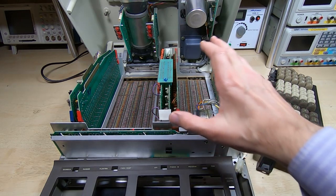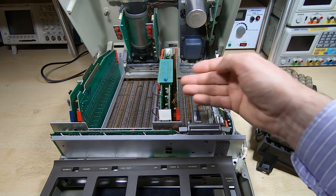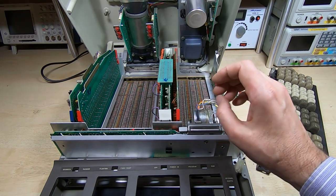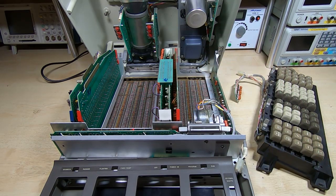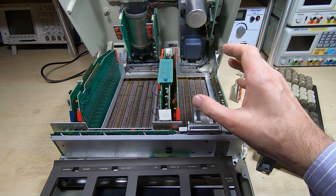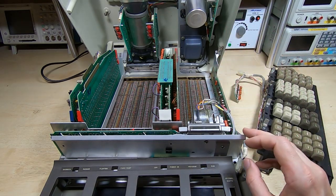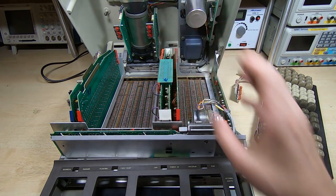I've reinstalled all the boards, the chassis, and the CRT. I went through all the boards in the same way that I went through the logic board — tested all the components as far as I could. I didn't video that because you're probably getting tired of watching me with a multimeter, but it was the same process: going through and checking all the signal paths, looking for anything that didn't appear right. Found a few things, mostly poor solder joints as I found on the ROM card, so I fixed those as I went, replaced one resistor that looked a bit the worse for wear, and cleaned all the contacts on all the edge connectors and the pins on the CRT.